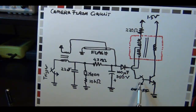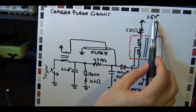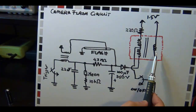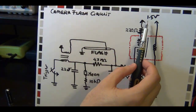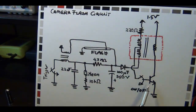So there is no current going down. As soon as you close the circuit, you can follow this connection - it goes through somewhere in the middle of the transformer and is connected all the way up to 1.5 volts. So you will bring some current and some voltage close to 1.5 volts at the base of this transistor, which will quickly turn this transistor on, causing a lot of current to go down from the collector to the emitter. Now as soon as you induce a current through this half of the transformer, this itself will cause a current to be induced on the other half. But as soon as you do that, the current in here will lower the voltage of the base to go down to even below zero - so then the transistor turns off again. But when the transistor turns off, this voltage will eventually go back all the way up to 1.5 volts, and then the transistor will turn on again.